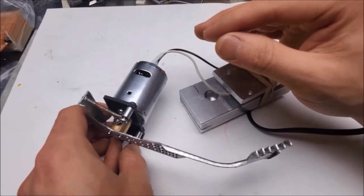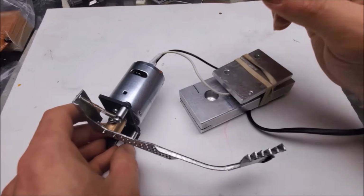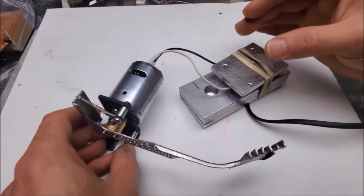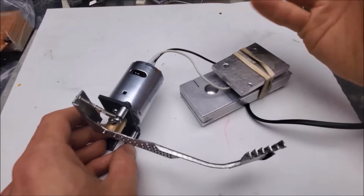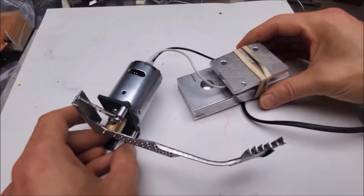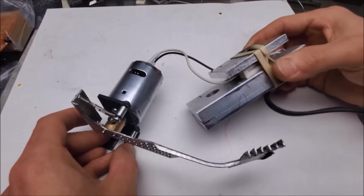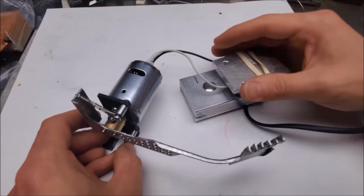However, the 5 volt power supply that I have installed inside of the laser will only adjust down to 4.5 volts, which means that I gotta drop about 4.5 amps at about 3.5 volts, giving me roughly 13 to 15-ish watts of energy that I need to get rid of. So I got two 2.2 ohm resistors here. They get rather toasty, but that's okay. We have a lot of cooling potential inside of the laser.